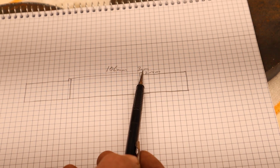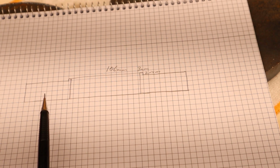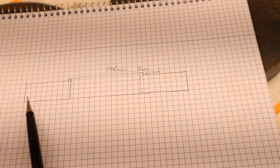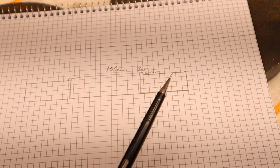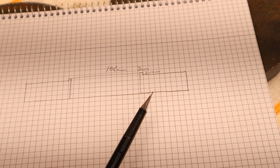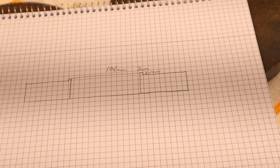So we need 6mm bigger there than on the ID, and the thickness of it is going to be whatever is left after we've faced both the sides and we've made that 2mm flange. So I'm thinking it's gonna end up somewhere around 17mm, and I'll make those two the same. But if they're 17 or 17.5 or 16.5, it won't matter.